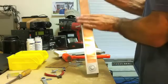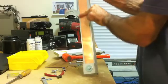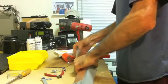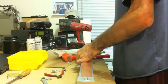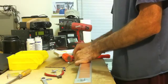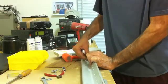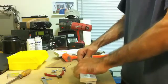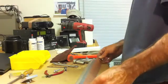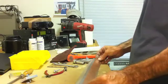In order to get this nice and flat on the other piece, I actually had to make this hole a little bit larger so when I push it down I can make sure it's nice and flat and there's some play in there. I put my other plate on here — fender washer, five-sixteenths bolt, nylock on here. I have the strap off: it's got one correct size hole and one a little bit larger for the adjustment.